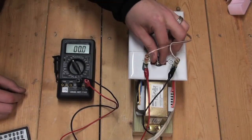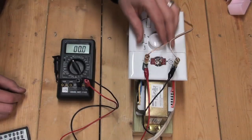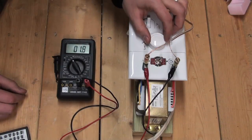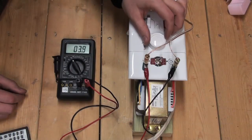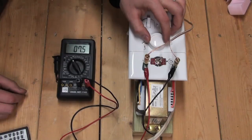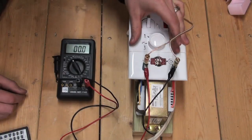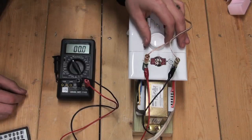Setting to circuit B, the power supply will output 12 volts, but tolerates a lower amperage. This higher voltage setting is important for smaller gauge nichrome wire or cutters that have longer lengths. As you can see, around 11 volts are achieved. With the toggle switch set to the off position, the power supply is not engaged.